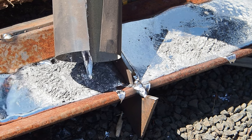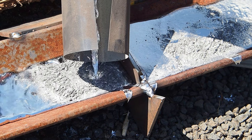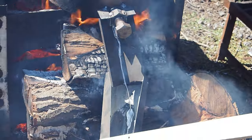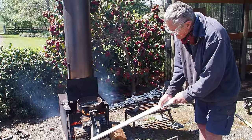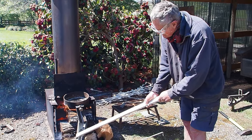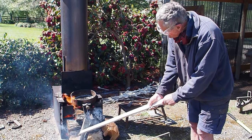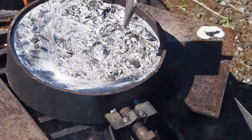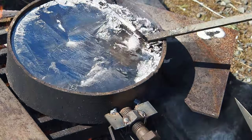The way we were set up here it was definitely a two-person job to keep it all under control. We used a big section of angle iron to create the forms, and the dividers that separated each of the bricks were more or less up and down — not exactly 90 degrees — which made it a bit difficult to get the ingots out. If I was doing it again I'd put a bit of steel on the ground and create a track so I could slide the forms along without spilling the ingots.